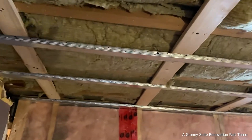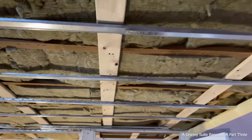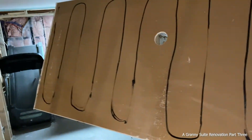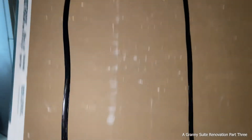The resilient channel is in. That's what the bead of caulking looks like — it can be a little messy. That's the acoustical caulking, and then the next sheet we sandwich the caulking in between. The acoustical caulking has been applied to the back of the sheet and you can see the first layer has been installed across the ceiling. Now for the second layer, this is where you sandwich some acoustical caulking in between the layers — this helps dampen the sound. You don't need to put a lot; you're just creating a little bit of separation.